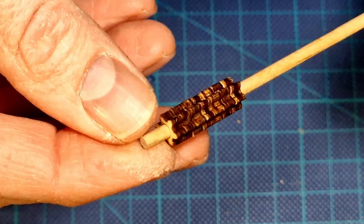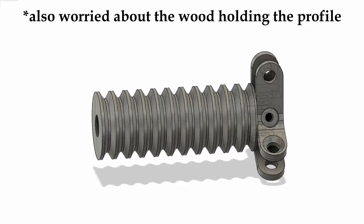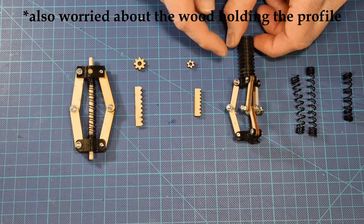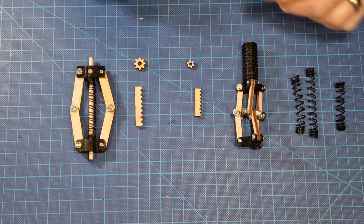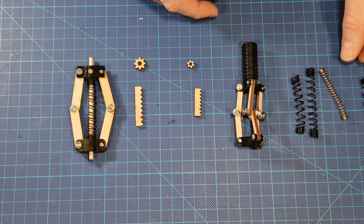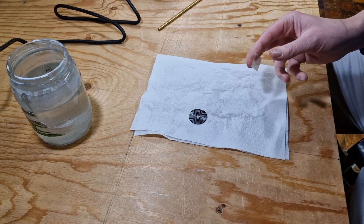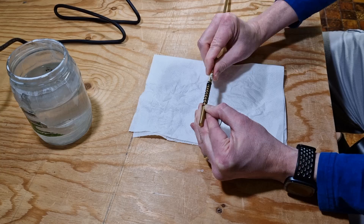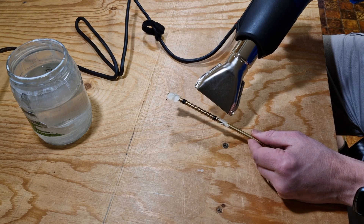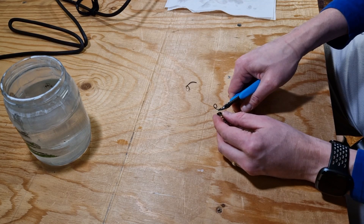The rack is much smaller, and with smaller devices there's far less tolerance for mistakes. That's one reason I 3D printed the rack part — my lathe skills might not be accurate enough for such small teeth. I also had to print my own springs; I initially thought pen springs would work but they were far too stiff for the device to open up. Springs were made by printing flat coils in PLA and PETG, wrapping them around a copper rod, heating with a heat gun, then dipping in water. I used both materials in a variety of thicknesses to find the right stiffness.